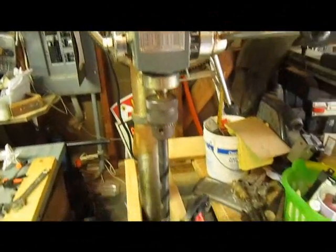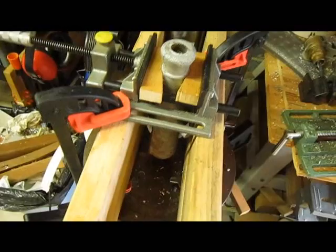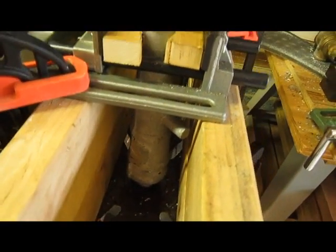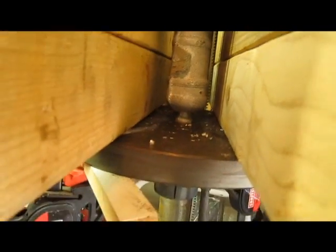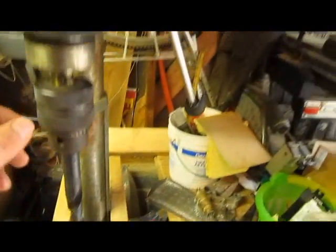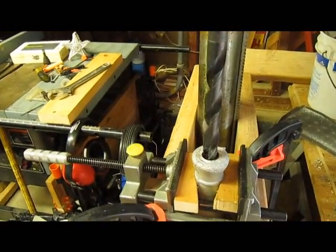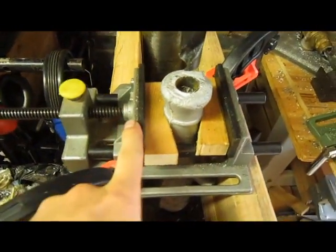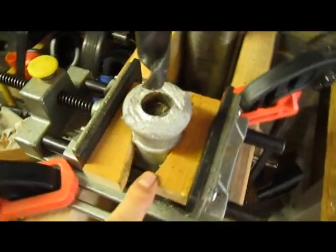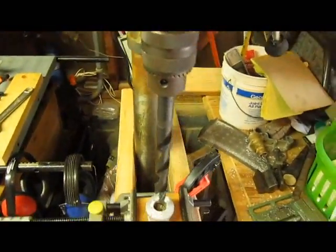We're in the garage again, and today I'm going to try and drill a cannon out. I don't have much time left on my camera, so all I can show you is the setup. I just have the cannon set up with the rear round portion — I forgot the term for that — lined up in the drill press, perfectly aligned with the chuck. I did that by putting a long rod through and lining it up. So the chuck is lined up and now I can drill straight down. I have this set up with a vise with some wooden centering pieces in there, and it's all clamped down to the table. It's very sturdy and it seems like it should work well.